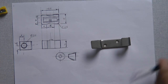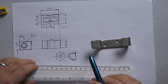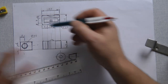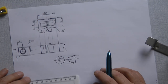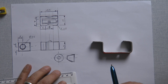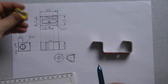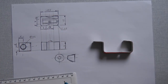If you're not very good at drawing by hand, maybe sketch your basic views lightly in pencil, then go over them nicely and sharply with a ruler. I wanted to keep those construction lines and keep it quite loose. I'm going to do another one and speed it up for the video. The key bit is laying out the views correctly — that's what it's about.